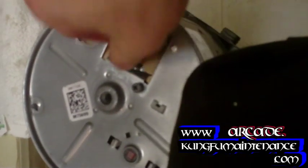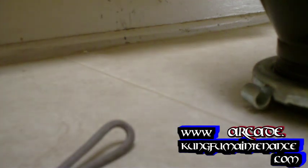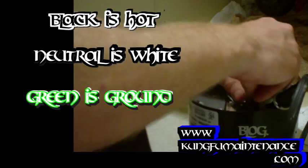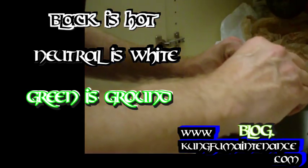And then we're going to take off our pigtail, take off our access plate here. Ground screw. When you're facing the outlet, the hot is on the right side generally, so you can follow the right side of the cord all the way back to here. So this one is going to be my hot. We're going to feed the wires into our disposal port here. I'm just going to hook up my hot so we don't forget which one's where. Twist these together a little bit, and then use our wire connector.